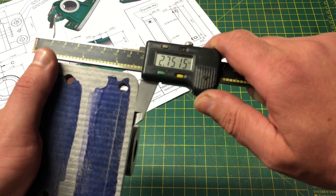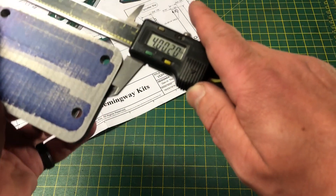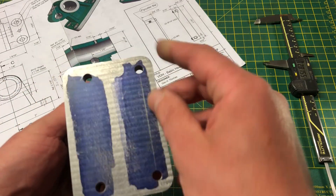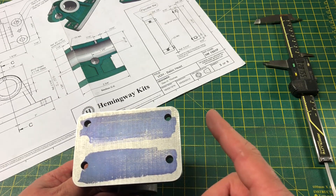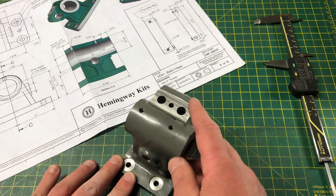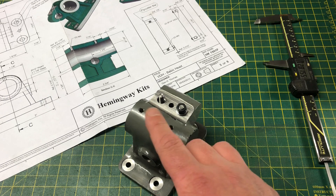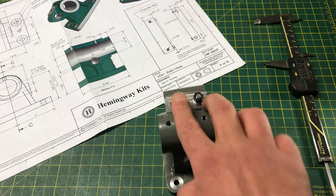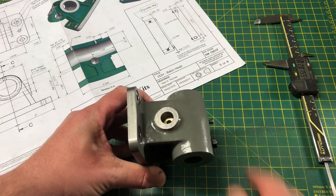Having a look at the work so far, I think we have acceptable progress. All the sides are machined square and to dimension. We have the mounting holes in the base. Those watching closely will have noticed that the casting moved on the angle plate as those holes were drilled — that setup was clearly not suitable for this operation, which makes total sense. The downward forces are quite high when drilling, and some jacks were required at an absolute minimum there. I have checked the hole spacing, and I have been very lucky to get away with that. We have the holes drilled for the tailstock clamping cotters, the two oil holes drilled into the spindle bore, and the tapped hole that will be used to clamp those cotters for machining is also complete. Additionally, we have the hole for the spindle clamp on the side, which will be machined with the main bore.